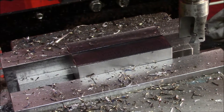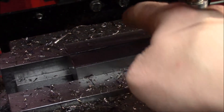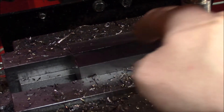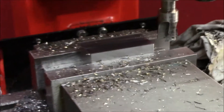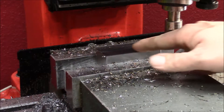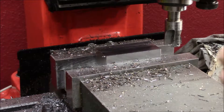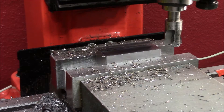As you can see, this was actually not a success — it is much more bumpy and circular, while the previous one is actually smoother. Maybe it's because carbide needs at least a third of a millimeter or so to work correctly. It makes a nicer finish on the lathe if I take a real cut with carbide. And maybe it could be this insert that's not perfectly new.